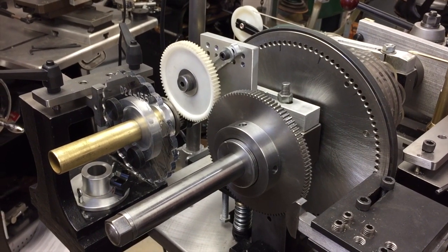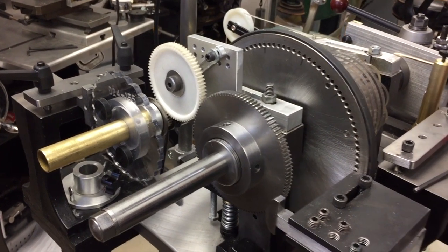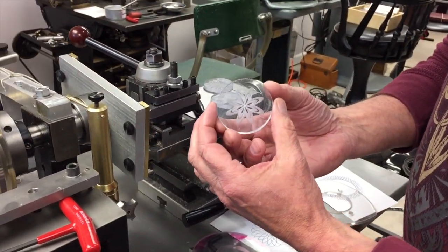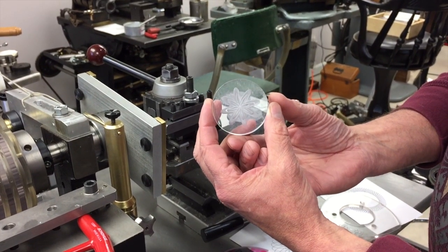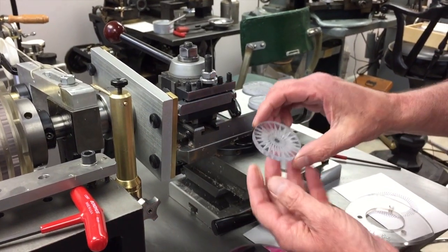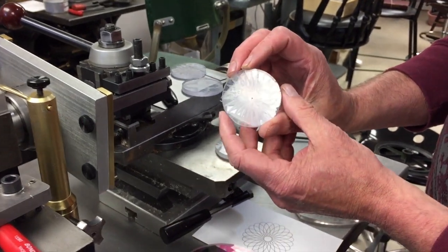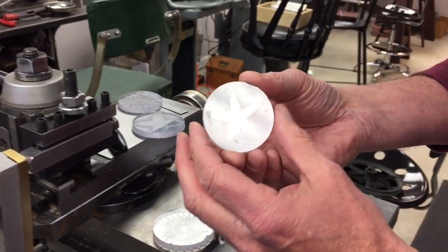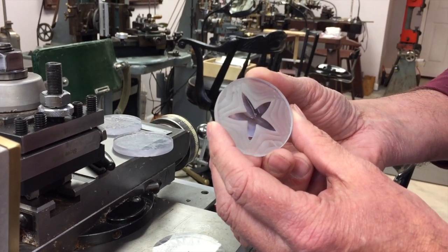on a paper chuck. When you see something that looks really nice on the paper chuck, you can put something on the regular chuck to give you some ideas of what it will do. This is about 5/8 amplitude, which you really can't get on most rosettes. This sort of look you can't get on any rosette, and it is really nice, aesthetically nice. This is mirrored plexiglass, and of course you can't make that shape from a rosette that looks like that.